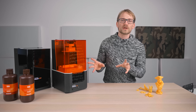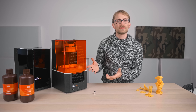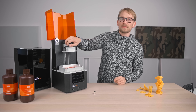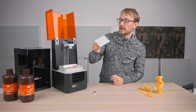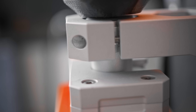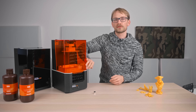Overall, the WiFi networking is nice to have, but I actually just ended up not using it. I'd take my USB thumb drive and just walk over to the printer, because I need to do that anyways to start it. The way the print bed mounts to the Z-axis is also really well done — it clamps well and there's no risk of changing the alignment of this ball head when you take off and reinstall the bed, like there is with some other printers where this ball joint assembly is a bit too loose.